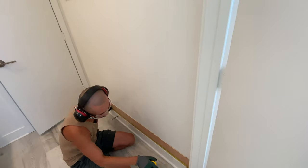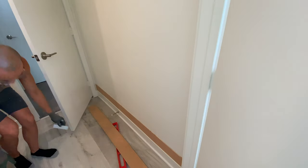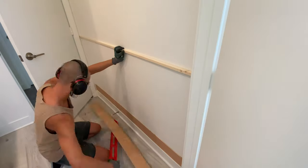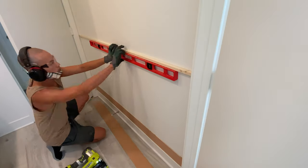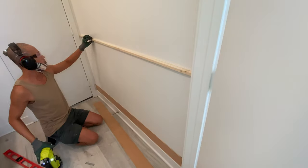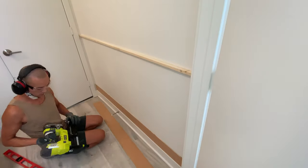For the first layer I cut my plywood into four and a half inch wide strips and nailed them onto the wall starting from the bottom. To create a divider between my lower third wall and the upper wall where I'll be doing diagonal shiplap, I put a square trim piece that is three-fourths of an inch thick and half an inch deep as a little ledge divider.